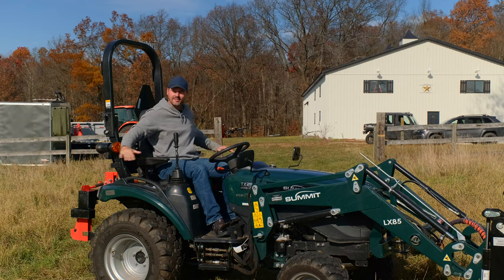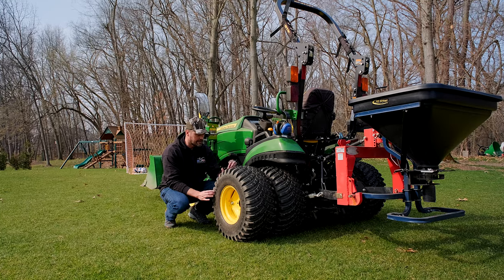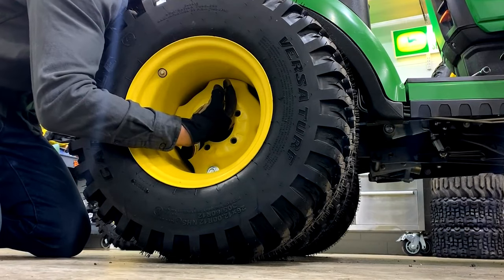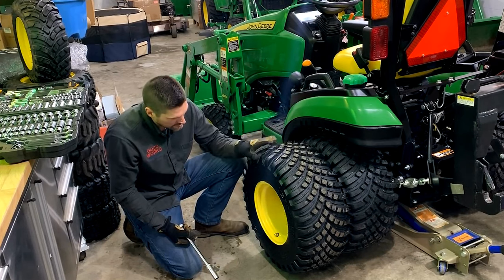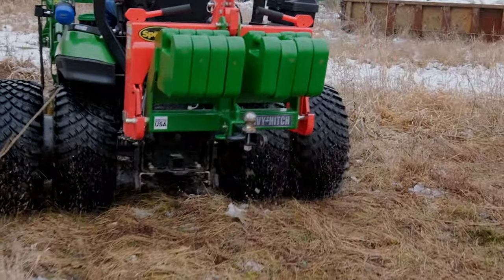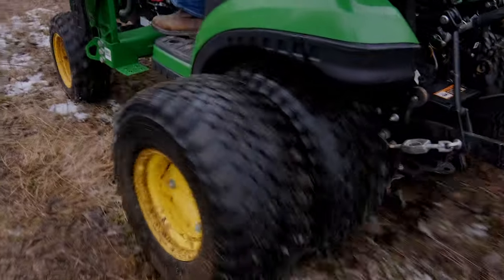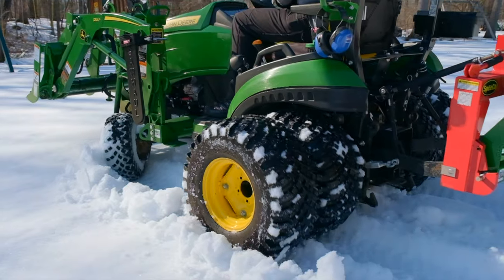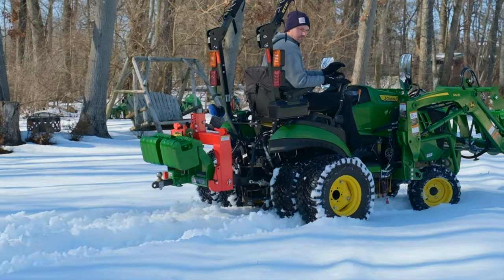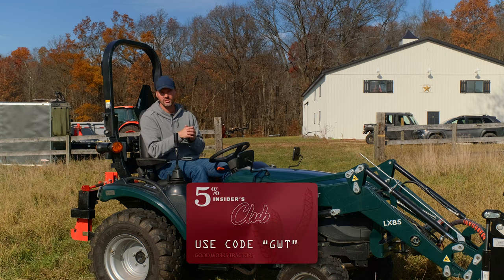Still on the rear axle before we move to the three-point hitch — a set of dual tires, dual wheels and tires. These are really only made right now for smaller tractors, the 26-12-12s, like the John Deere 1025, 1023, your whole Kubota BX lineup, and similar size tractors. Typically that's not going to work with a mower deck, but if you don't have a belly mower, that can be a really good option. Some trade-offs to consider: potentially more axle stress with another 12-inch wide tire. But as far as stability goes, they made a huge difference when I ran them for a full year — I saw no detrimental effects and felt incredibly stable. These are sold by a partner of ours, millertire.com — save 5% with code GWT.